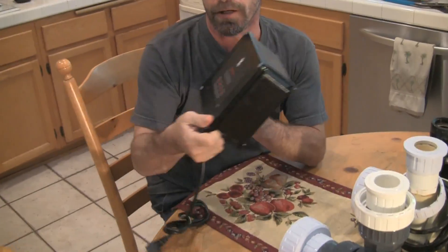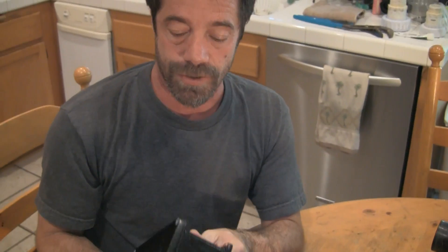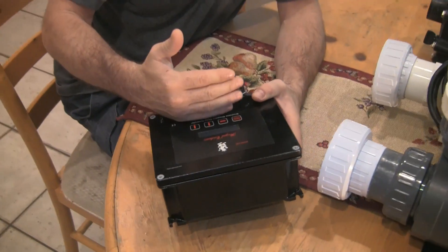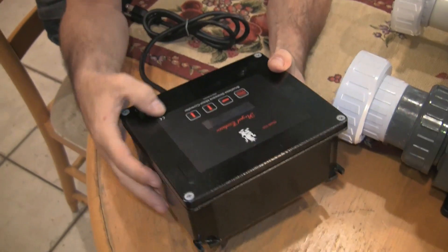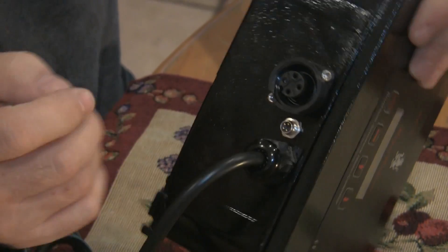They have a power supply and a controller — this is the controller for the RD3 230 watt pump, and the pump plugs into this controller. This plugs into the wall, and through the control interface or through a controller like an Apex, you're able to control the flow. By adjusting the flow rate, you adjust the current draw. So I may not need 5500 gallons an hour, and this will allow me to bring the wattage and flow down and ultimately save power. There's also a plug port here with a cable that allows me to connect it to my Apex.